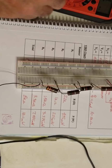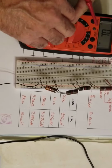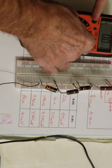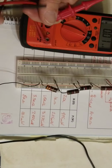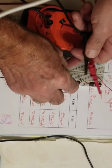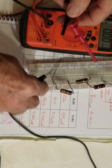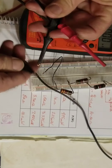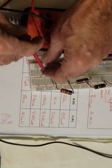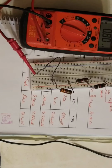And then I will want to measure current in one place. When I measure current, remember, we take a red lead, set this up to read current, and when it makes that sound, you know you need to change your position on your meter. Then I'm going to disconnect my circuit in any place really, because this is a series circuit, so it doesn't matter where I break it. This time I'm going to disconnect at the negative end of my power supply. I put the 2 negative ends together with the circuit between the 2 positive leads, and now I'm reading my current. I'm reading around 0.8 milliamps.